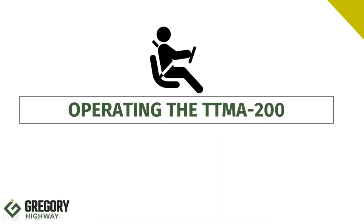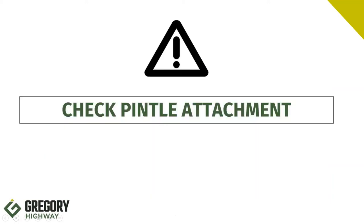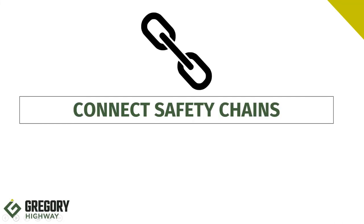Additional operational guidelines. Operation of the TTMA 200 is similar to many other trailers. Special attention should be given to the following issues. Verify that the retaining pin for the pintle hook is properly locked in to avoid accidental release of the pintle hook and the lunette ring attachment of the TTMA 200. Make sure that the trailer lights are connected to the tow vehicle and that they are operating properly. Ensure that the safety chains properly secure the TTMA 200 to the tow vehicle.